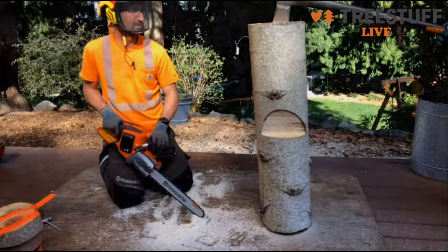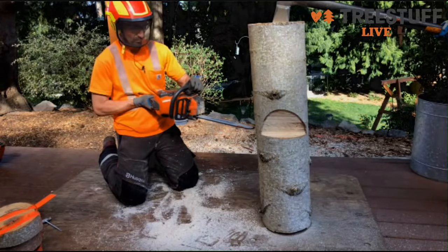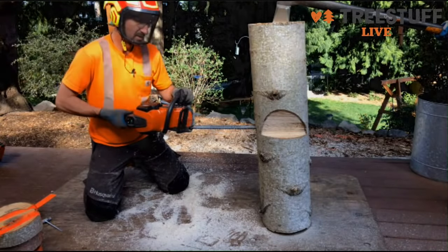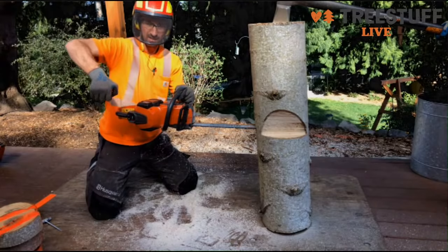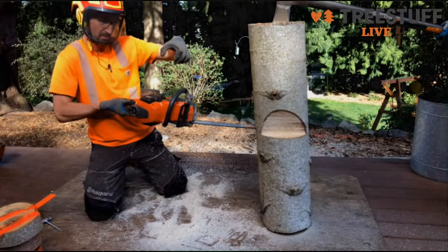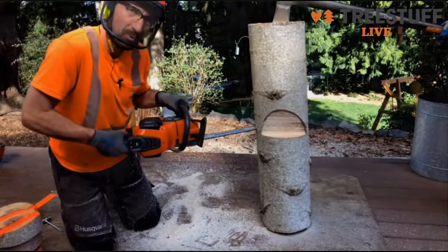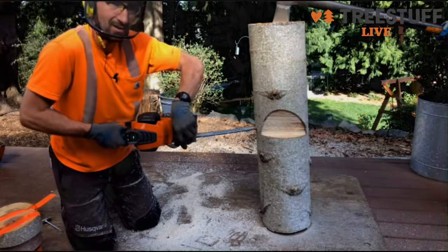All right, back cut, stand clear. Thumbs are wrapped, right? Did you see it? I engaged the saw and I'm moving toward the camera now. I'm moving toward you. High speed. This is full throttle. And you'll see I'm using my thumb back here on the trigger. I'm not trying to wrap my arm underneath. I've got my hand on top of the saw, thumb wrapped here, operating the saw with the thumb of my right hand. At this point, the bar's only an inch or two into the tree, but it's well engaged, and I can bore out the other side.